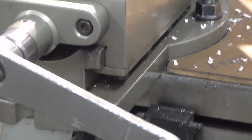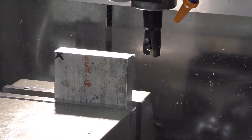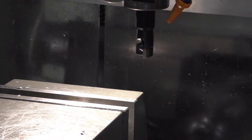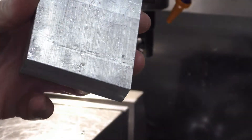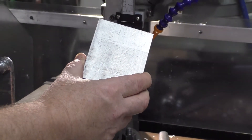And it uses TPG inserts. This particular unit was made in Poland — three quarter by three quarter. Clean that up there. This is, like I said, the first little rough-edges indexable that I ever bought. That's pretty well done there, very good. What we're going to do now is take deep cuts into mild steel and aluminum. Anyway, that uses TPG inserts.